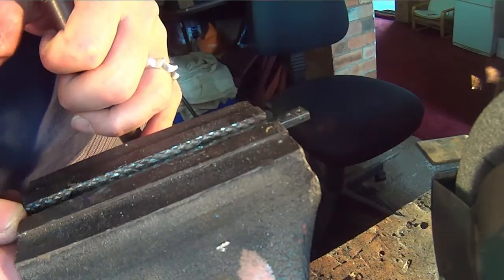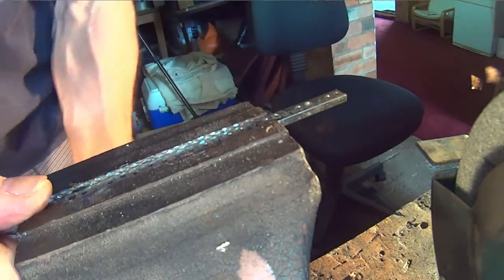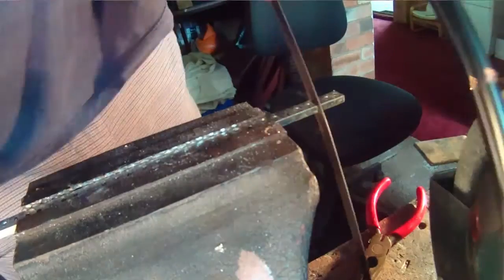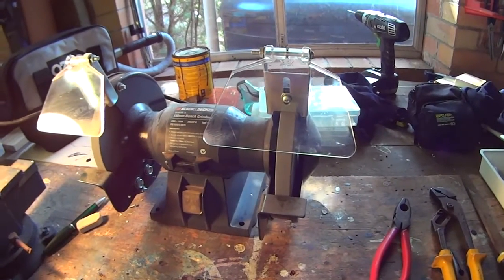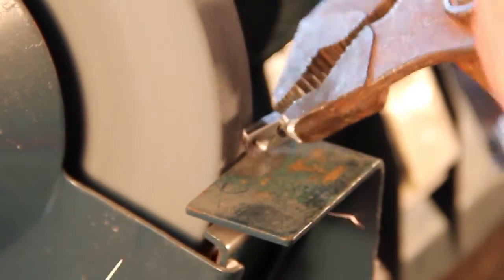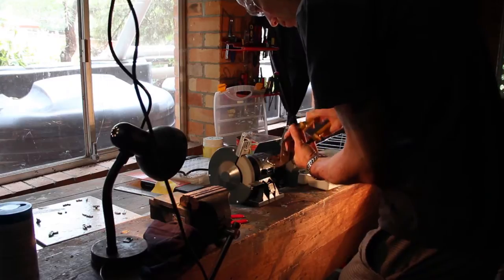I just keep trimming these off until I've got a nice little bucket full of metal. One important thing while we're doing this cutting of steel — you can probably see chunks of metal flying off — I've got a pair of safety goggles on, and if using any power tools I'll make sure I've got ear protection as well. Doing it once or twice isn't too bad, but eight hours of grinding is noisy and you end up with ringing in your ears. Now I'm using a good pair of adjustable pliers to very lightly shape the end of the piece I've already drilled out.